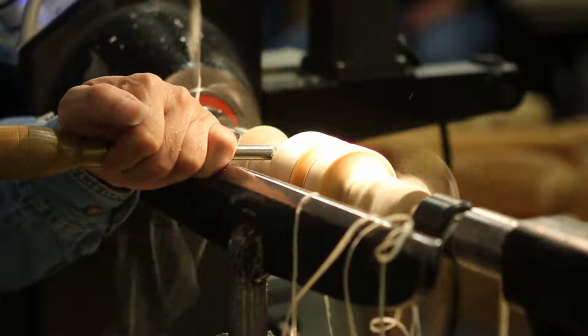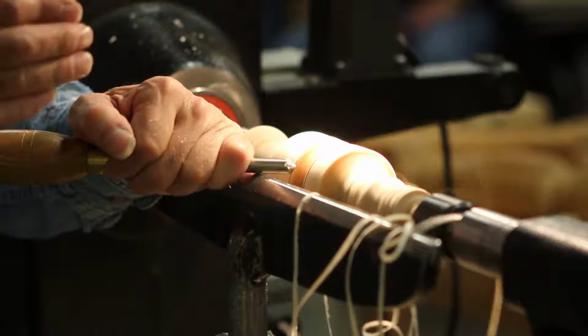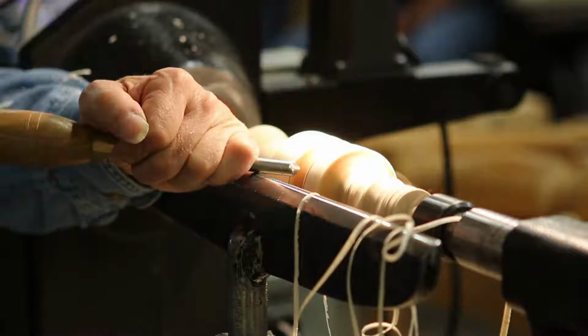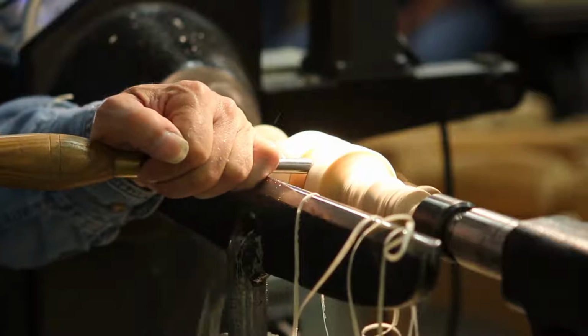But I would say this, and you probably already know this, that when you're making that piercing entry and you've got that edge, if it's going to catch, you want to err on the safe side. You want the chisel to be thrown to the left into the space. You don't want the chisel to be thrown to the right into the good wood that you need. So you err on the safe side, you overcompensate, and you roll the chisel over a little bit too much to the left, so when it enters, it might just jump to the left, but that's okay. You just don't want it to go the other way into the wood that you need.